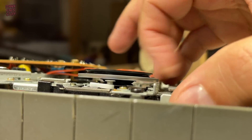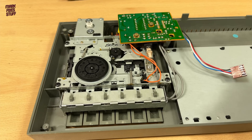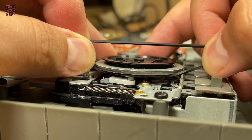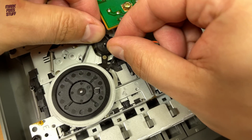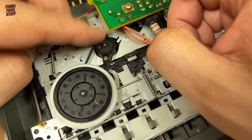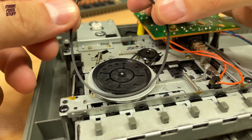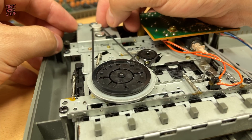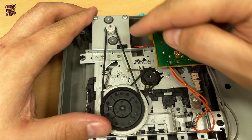We can see that we have good clearance of our repaired pause latching mechanism. Now that the glue is dry, we can test the latching by manipulating the underside of the pause key. Let's put some fresh belts on. The smaller belt is AV Belt 74 from CPC Farnell — pull it on over the top of the pause latching mechanism so that it clears the part we glued. Don't worry about keeping the belt straight; a square section belt should auto-correct itself. The larger belt is AV Belt 107 and is much easier to fit. Just make sure that the belts are running freely — if turning the flywheel means that the other pulleys turn, it's usually a good sign.